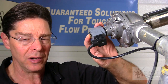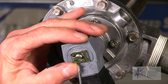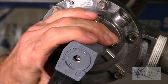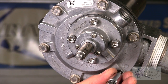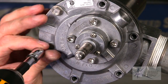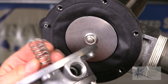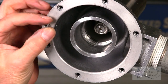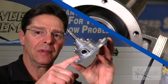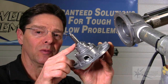First we have to take off the solenoid coil to get at the rest of it, and then we can take off the bonnet. We've de-pressurized the system and turned off the power, so now we can remove the coil and service the valve. We remove the clip, take the coil off, and there's the spring, the diaphragm, and the bleed pin. Here's the main bonnet — the upper bonnet with the secondary or upper diaphragm still in it — and the solenoid. We're going to work on this on the bench.